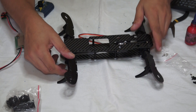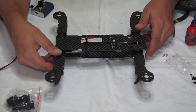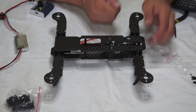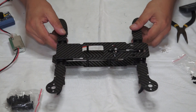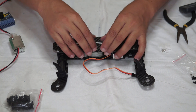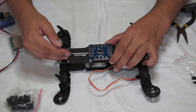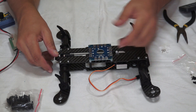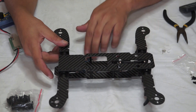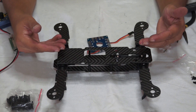There is still a possibility that when you connect the servo to your receiver and configure your flight controller, your servo might be out of center. But that is easy to fix at the hardware level — simply remove the servo arm and reinstall it on the servo making sure it's perpendicular. For now we are ready to install the electronics: motors, ESCs, and power distribution board. We are going to solder the ESCs to the power distribution board and add connectors to power our FPV system. Then the next steps will cover how to install the flight controller and receiver.